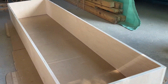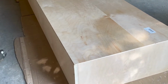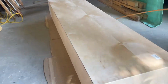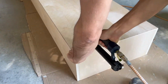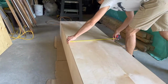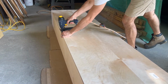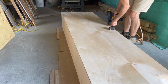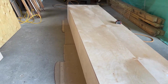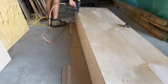So next you're going to want to flip the bookcase over and apply a backing to the bookcase. We did this using a 4 by 8 sheet of veneer plywood, again maple, which was a 1/4 inch thick. And again, we had this sheet cut at the hardware store into 8 feet by 25 inches. We secured the veneer to the back of the bookcase using an air nailer which contains staples, and applying those staples approximately every 4 inches along the frame of the bookcase.